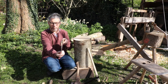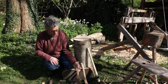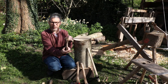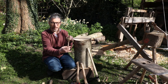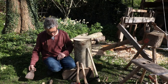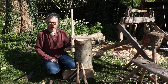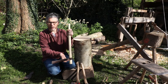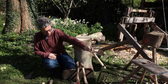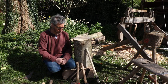A wedge-shaped axe, when you put it into the split you're starting, keeps on opening up that split. You can get other patterns of axes — this one's more of a felling pattern, it almost goes straight up. You'll get the split started, but it will just keep going in and won't open up the split, so it's less good for cleaving. You could use the more traditional froe — F-R-O-E — something for levering open. I will use that sometimes, but I tend to use axes. You don't need the froe, to be honest — it is useful especially when cleaving long things, but we're not going to concentrate on that today.